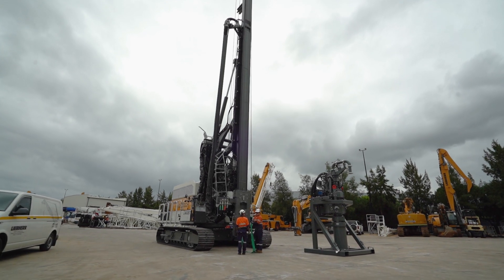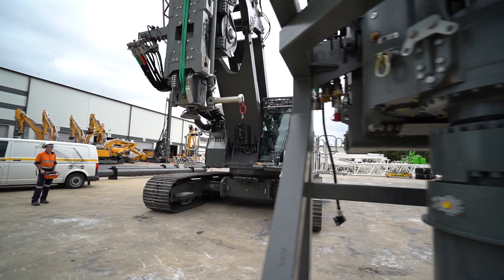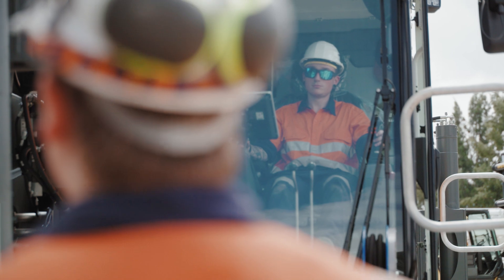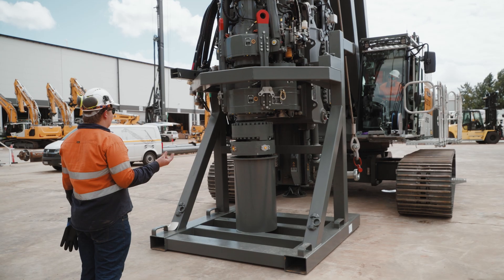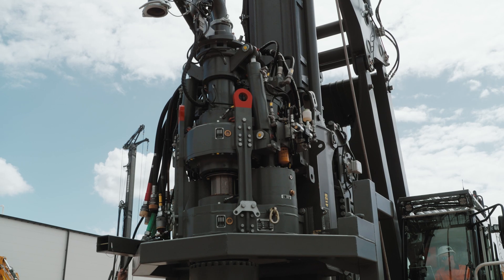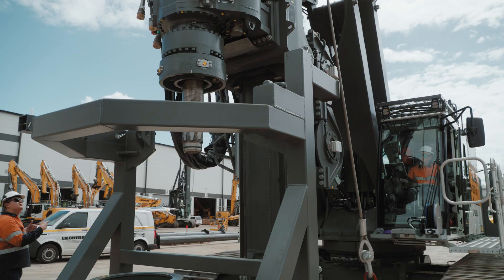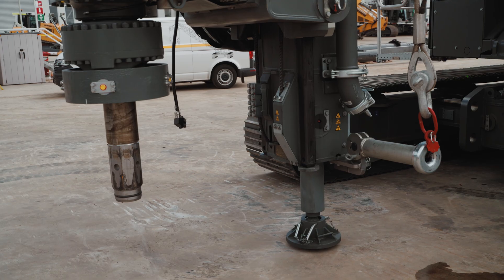Fitting the double rotary to the sledge — as you can see it's got a nice stand as well, which allows the customer to easily transport the drill drive laid down on the truck. On site, it allows easy access to pop the drive on and off for maintenance, service, diagnostics, or repairs. We'll lift it out of the stand, lower it to the ground safely, hook up the hydraulic and electric quick couplings, and put the parallel pull in place off the Kelly rope.